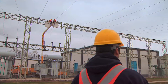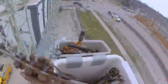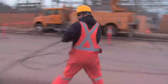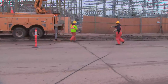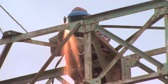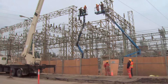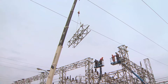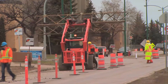We cleared one 66 kV line that went over to Scotland station from Stafford station. We stopped traffic, dropped the conductors, and now we're going to salvage two bays of steel with the girders and columns. After that, we'll pull in our new 266 wire, hook it up to our switches, get rid of some of the breakers underneath, re-energize that line, and then the following week do the next line.